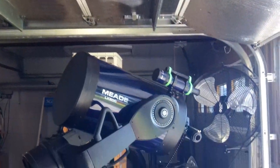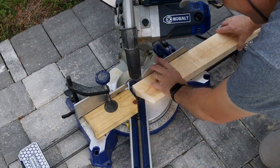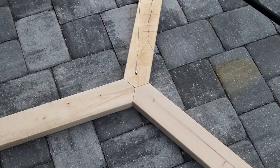When looking at the height of the total system, keep in mind clearances for getting in and out of doorways. If you have a miter saw, you can cut 30 degrees off each side of these 2x4s to give yourself a nice 120-degree angle on each one so they fit together nicely.